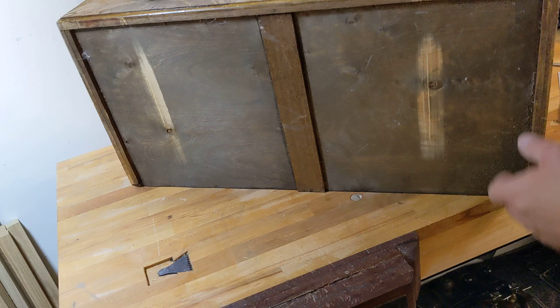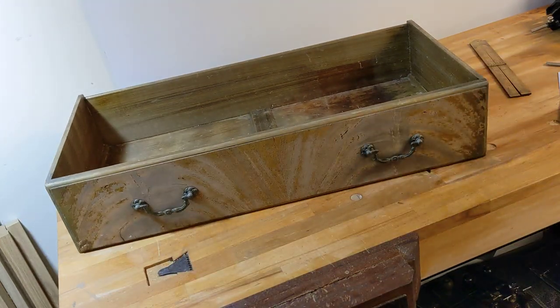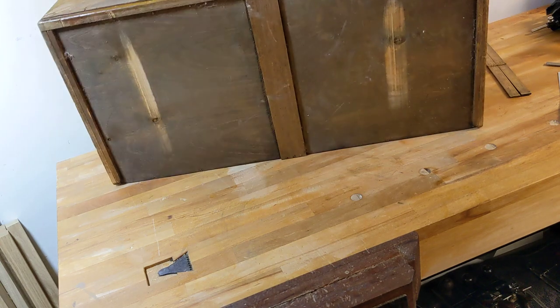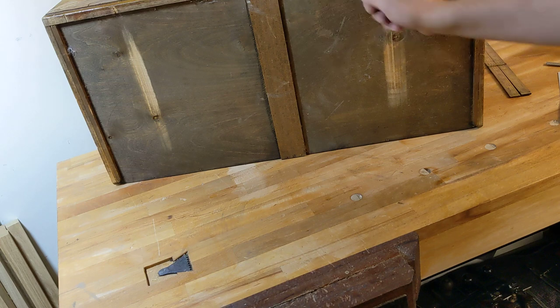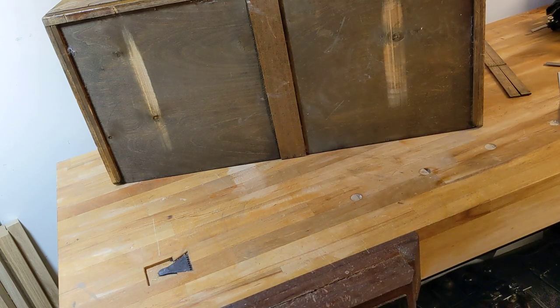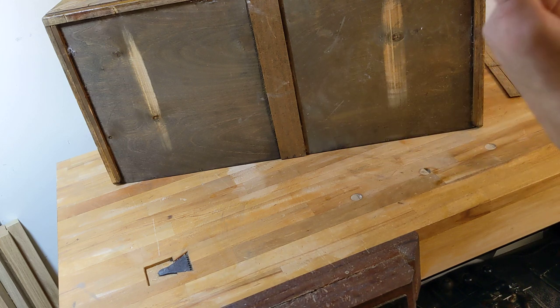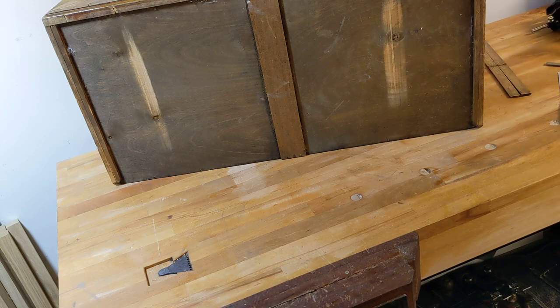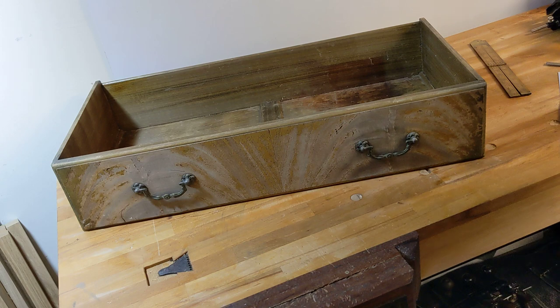Now, certain times drawer slips might look a bit funny, would be if you're doing some kind of vernacular work where you're kind of recreating something off of a basic dresser. A lot of early drawers simply had boards that were nailed front to back, like floorboards, with nails all in there just to hold it all together. Now, if you make an 18th century high furniture style drawer in that setting, it's going to look a bit hokey pokey, but, you know, give it some thought. I don't know why drawer slips aren't more popular.